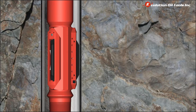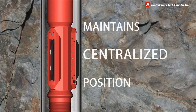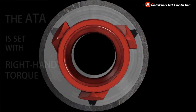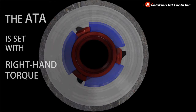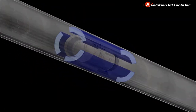The design of the ATA also means that the tubing string will maintain a centralized position in the casing. In the set position, the ATA torque anchor offers greater than 95% of the potential bypass available past a similarly sized EU coupling. The large bypass area facilitates gas breakout and can help increase production in many cases.